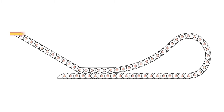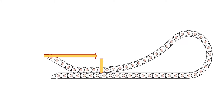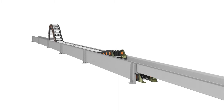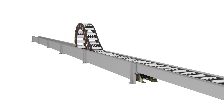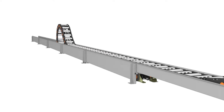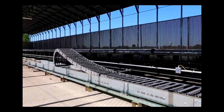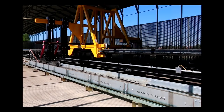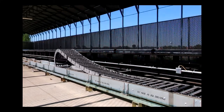The traditional solution to this problem was to redirect the force vector by lowering the mounting height of the carrier. A guide trough maintains lateral stability and ensures contact between glide shoes. It does, however, present challenges. Guide troughs must be straight, which can be both an installation and maintenance challenge. Carriers that glide on themselves are subject to wear and can catch and drag on the sides of the trough, causing link damage and changes in tow force. The lowered mounting height requires additional carrier and storage space, increasing costs.